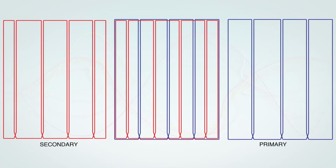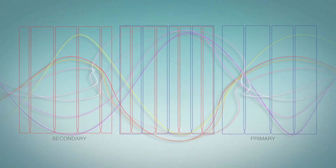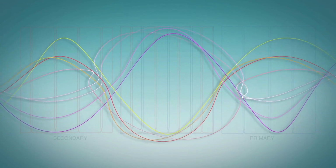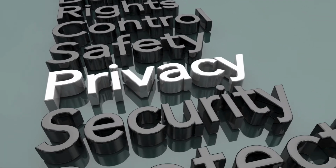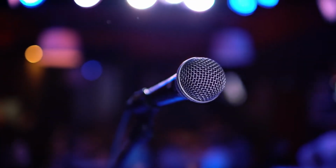The loop segments can be larger without much detrimental impact until they cause too much variation in the signal. The amount of spill can also be a factor in determining the maximum segment size. This is critical when it's necessary for privacy or to keep the loop signal away from a performance area with musical instruments and/or dynamic microphones.